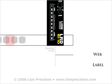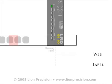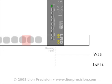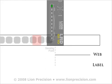Now we'll look at the LRD6110 and the Ultra LRDV2. Rather than measuring changes, the LRD6110 and Ultra LRDV2 measure the total thickness of the web. During setup, the sensors are calibrated for the thickness of the liner. Any thickness greater than the liner is detected as the presence of a label.